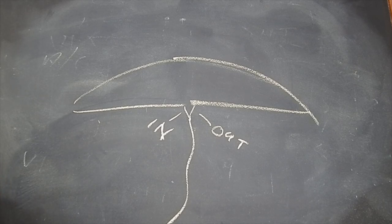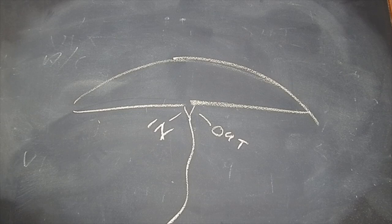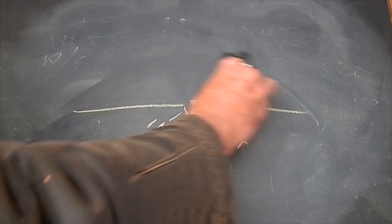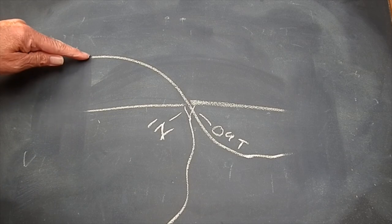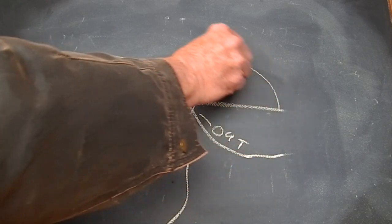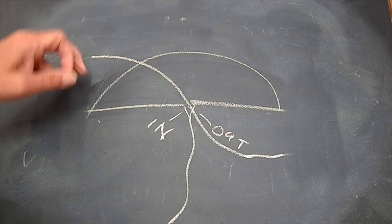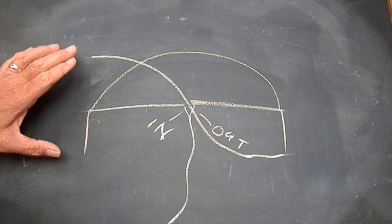That's one myth. Don't message me and say that's wrong — this is just a fact. Look it up anywhere on the internet. The current distribution is like that. And the voltage — maximum voltage at each end, minimum voltage in the middle. The current is the bit that does the transmitting. This is why they say if your dipole isn't long enough you can drop the ends down, because they don't radiate much — it's all voltage at the end.